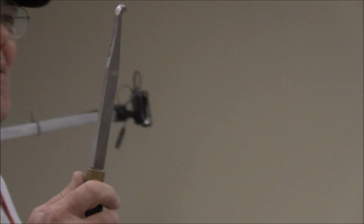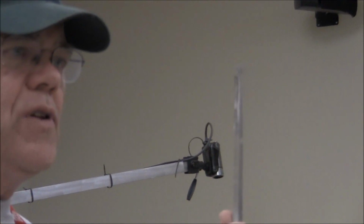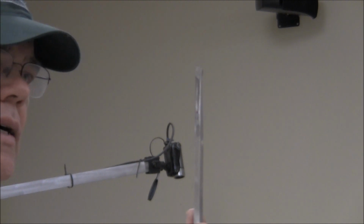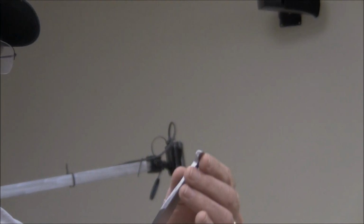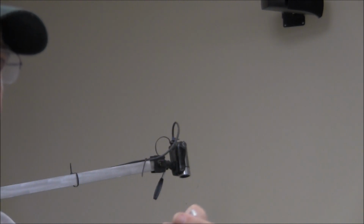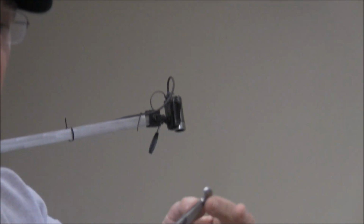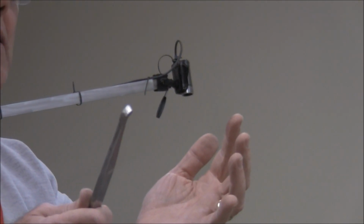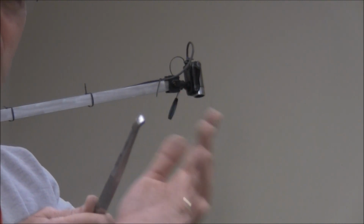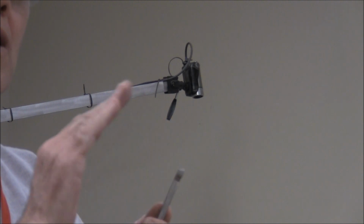So I wound up with a lot of Harbor Freight tools. This is what I'd call the Dale Nish style, and if you look at Craft Supply, they've got his signature version of it. I'd seen a couple of them. I think Ted Riggs had one. It's a real pain to regrind one of these things because it takes a long time in that high-speed steel to get it ground. But once you get it ground, it doesn't take a whole lot to true it up, and most of the time you can just take a hone.